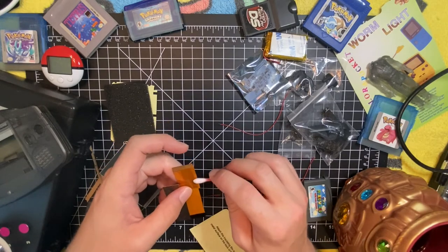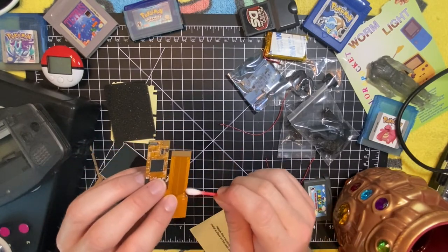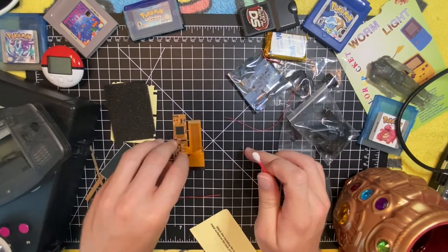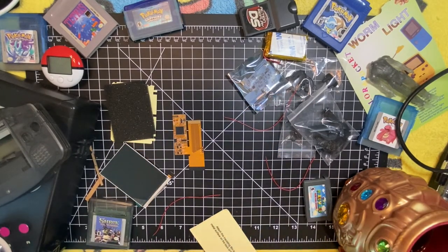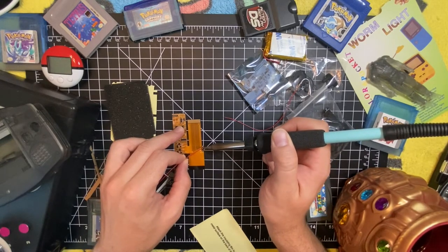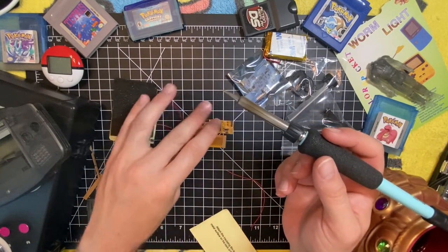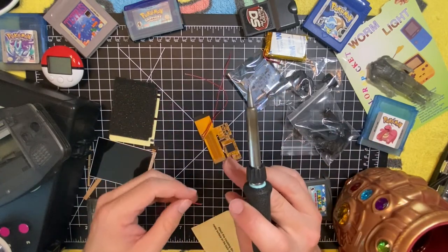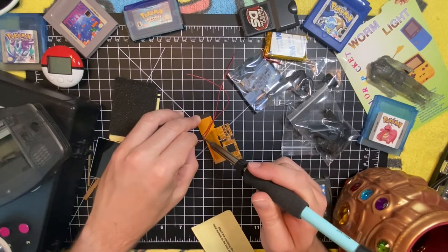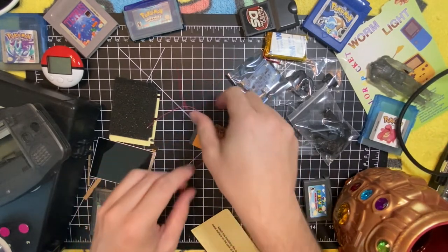Isopropyl alcohol on a Q-tip. Some of the paint came off from this cut pad. Next we're going to solder on these wires. This ribbon cable does not need much heat from your soldering iron, so I actually had to turn mine down — it was around 700 degrees before for soldering PCBs. I also do guitar effects pedals and you need it pretty hot for that. Easy peasy — you got this little clip that's going to clip onto the ribbon cable.